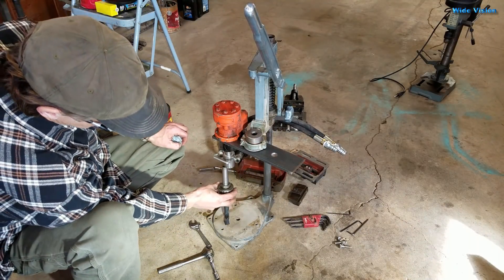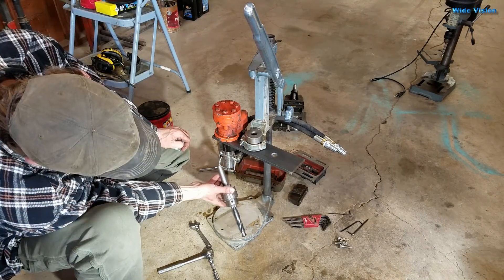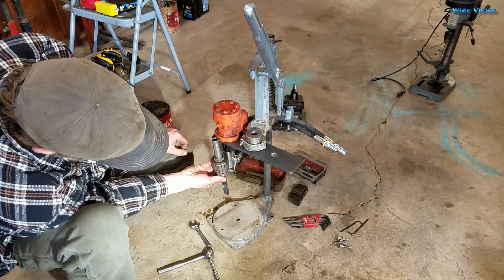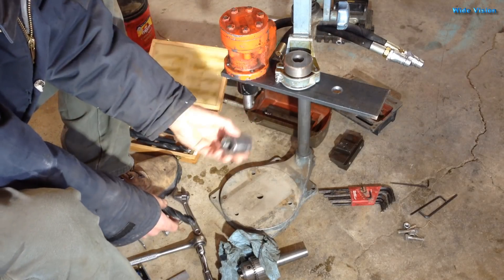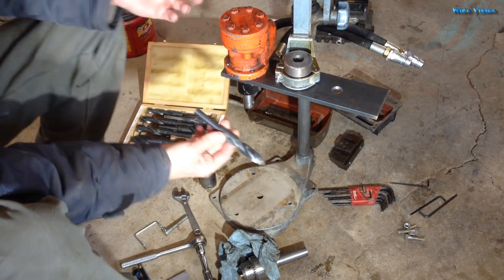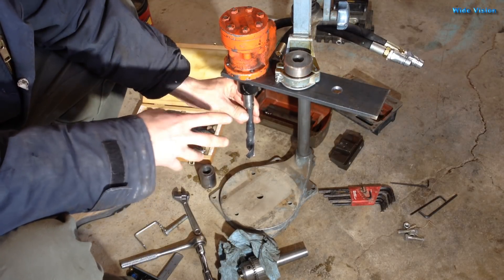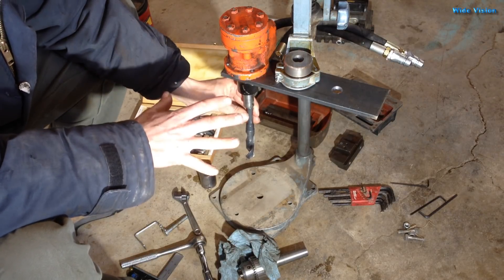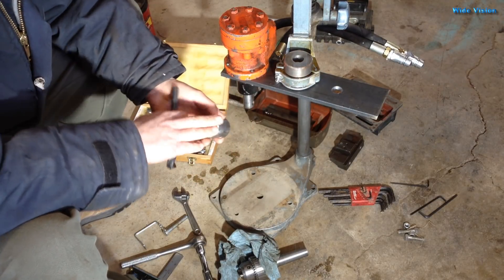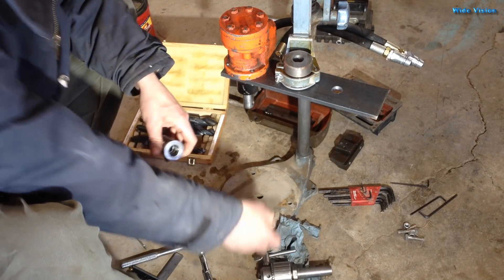I think I'm gonna be fine if I just had the drill bit itself go right into this adapter. I pulled the ring roller adapter off and just stuck the drill bit up here. All the drill bits in my set that I want to use are all the same length. I've got just barely over six inches of gap there, which in my mind is enough to get over a six-inch piece of square tubing. I think I want to make an adapter that is basically the same thing as this, instead of making a morse taper — I don't think I can do that because I don't have the room.